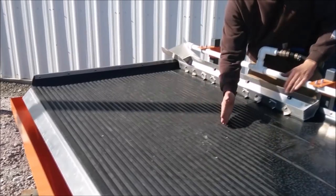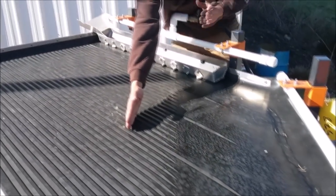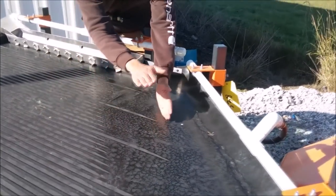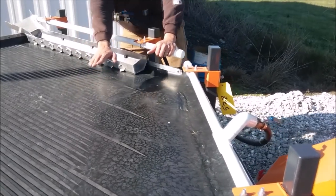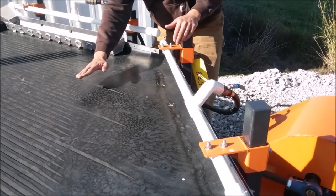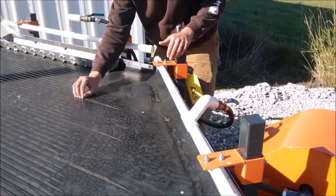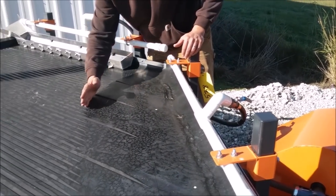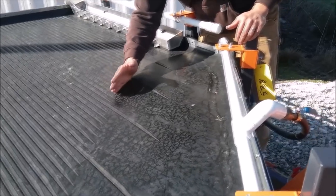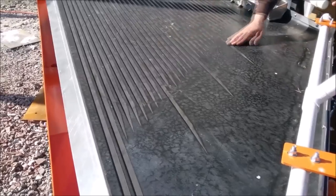This is a flat plane. Starting about here, running diagonally at 45 degrees down the shaker table, and ending about here is a ramp that we build into the shaker table top. It's about a quarter inch distance from the top to the bottom, and this allows the dense material to stay in the grooves and come up the ramp. But the light material — the quartz or plastic or any other light and less dense material — stops at the end of these grooves and can't make it up the ramp, and flows down into the tailings trough.